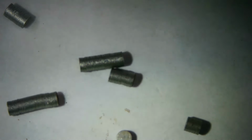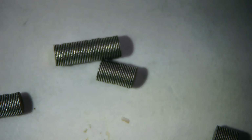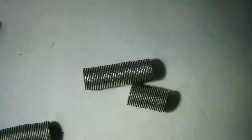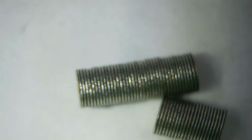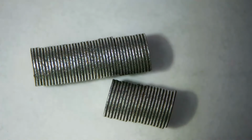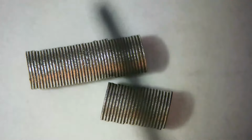Those are individual diodes stacked in a row, stacked on top of each other. So if you wanted, say, you take a 4001 and you wanted a higher voltage, you put three or four of them, and the current wouldn't be any greater, but you'd get the higher voltage, right? So here we are. When I want to get up as high as, say, 15 or 20,000 volts at low currents, which focus typically was, there's the stack of diodes. Each one of those wafers is an individual diode. And what's the spring for? The spring was there to keep them all pressed together.